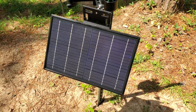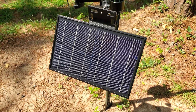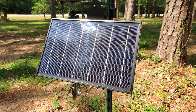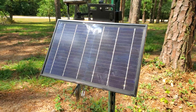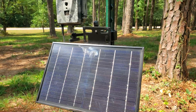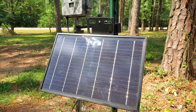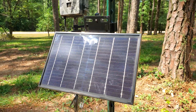Our black all-black monocrystalline solar panel — 12 volt panel. Something that a lot of people don't really understand is that with a 12 volt panel to charge a 12 volt battery, you're going to be in the 20 volt range. This panel actually has an open voltage of 22 volts. Once you hook it to a load that drops down, but I typically see about 20 volts going into that Ghost camera in full direct sunlight, so it's going to charge that battery up. The camera has circuitry to protect it from that high voltage.